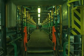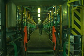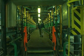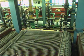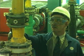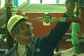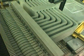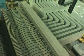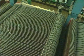This room contains 53 membrane cells. Membrane cells are cheaper to install than mercury cells and easier to maintain. These particular membrane cells are electrolyzing potassium chloride. The electrolysis releases chlorine at the anode, hydrogen at the cathode, and produces a solution of potassium hydroxide. These cells use a current of around 80,000 amps, and these are the bus bars carrying electricity to the cells.